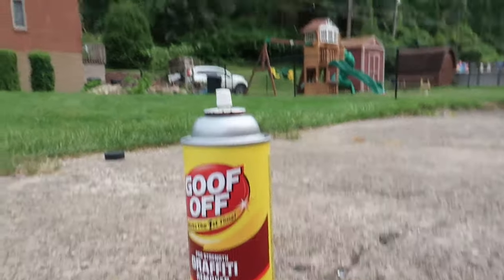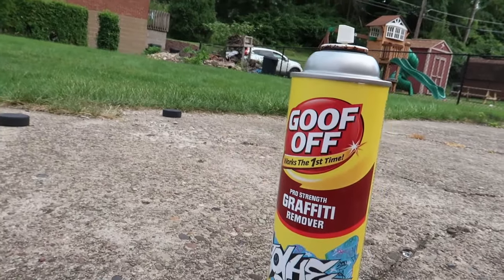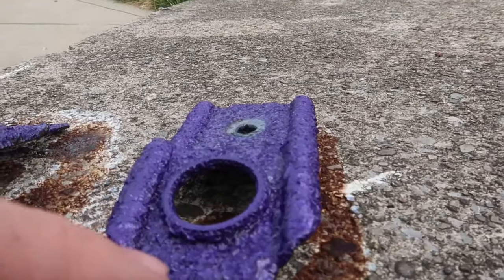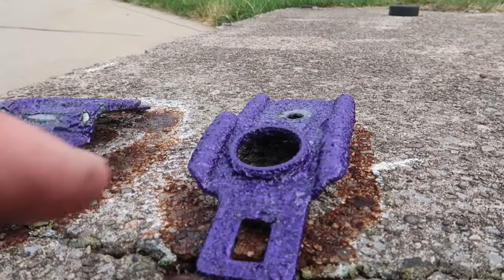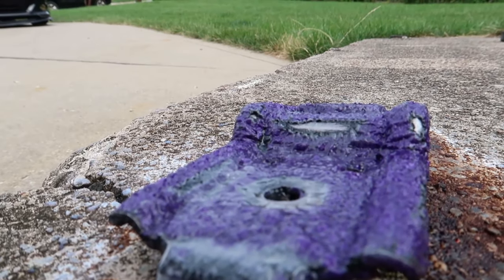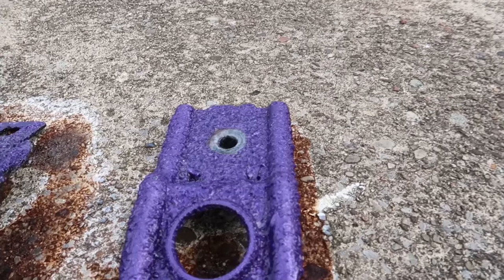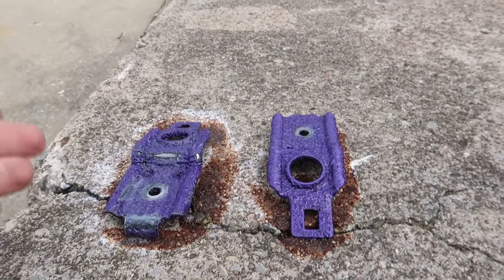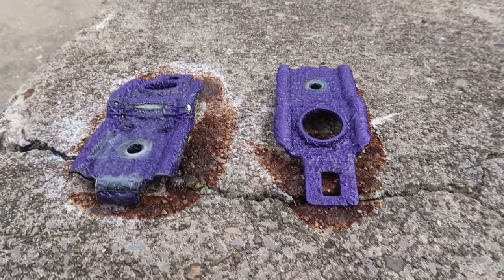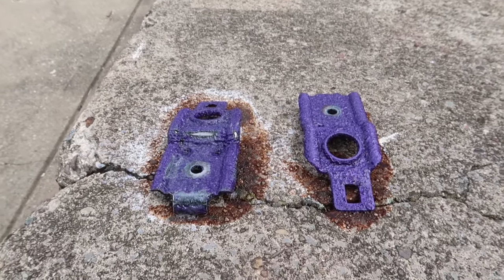I just got back from the store — I didn't really feel like sanding and I picked up some of this Goof Off. I've also used aircraft paint thinner before, which is super industrial grade, but I figured with all these little grooves it would be really difficult to sand. This stuff's actually peeling the paint off really well, so hopefully I'll just be able to wipe it down with a shop rag and it'll all come off. That way it'll be a completely clean surface and we can just spray some primer on it, cutting the time down quite a bit.